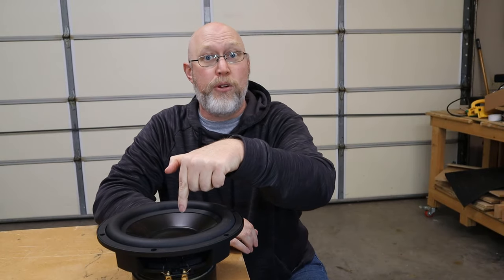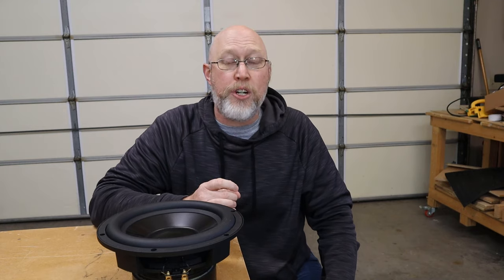I know what you're thinking — you want more bass, and if you turn the bass boost down, you're going to get less bass. Well, that's true. But the thing to remember is that when you turn the bass boost up, you're going to get distortion, you're going to get clipping, and you're going to damage your subwoofer. What you actually want to do is set up your gear properly: set the gains correctly, set the crossovers correctly, and turn that bass boost off. If you want more bass, a better option will be to turn down your mids and highs — it's always better to cut instead of boost.